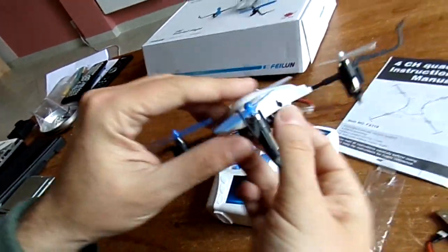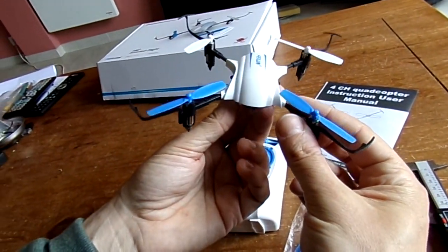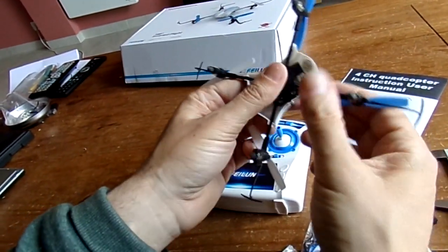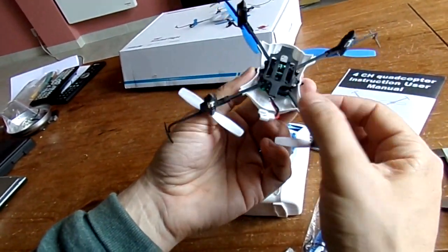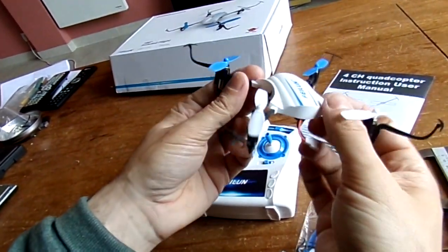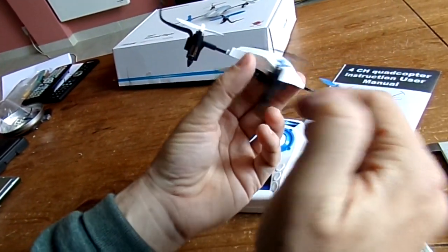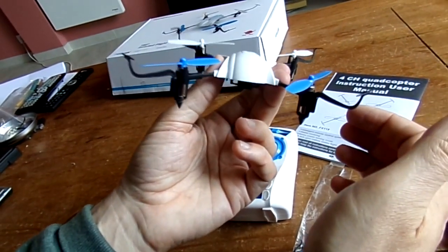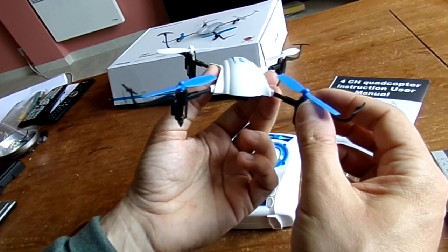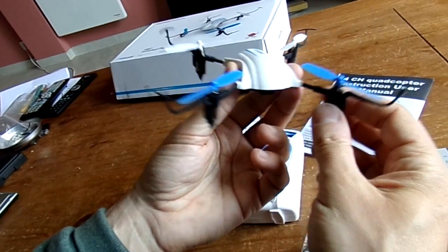Okay, concerning the electronics inside, you will have the InvenSense 6050 for the 6-axis stabilization. An ARM core, I can't remember well if it's an STM32, which should be a compatible one, but the RF chip is an LT8910. It's not a very used RF chip, and this one has a very low data rate. It means that the radio protocol should run at something like 250 kilobits per second, even lower if I'm not wrong, according to the datasheet.